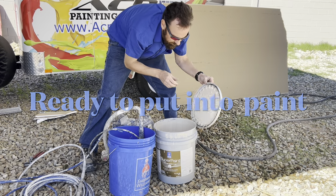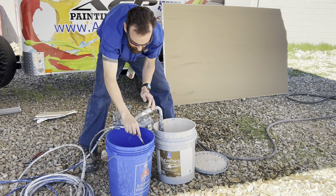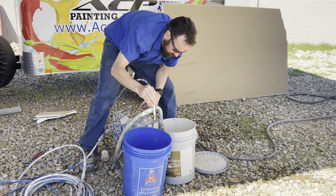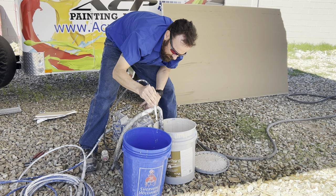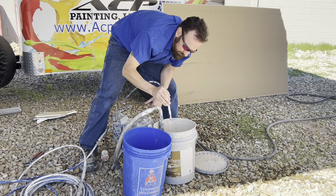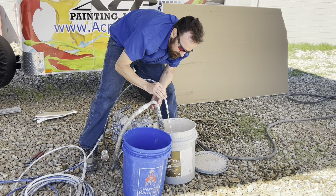Now we've inspected everything, ran the water through, and we're ready to go into paint. We'll put the pickup tube directly into the bucket of paint. One tip: if you're using paint that's not brand new — or even sometimes when it is — it's a good idea to strain the paint first, because that can easily clog up your rock catcher on the intake tube. Prime through until we see paint coming out of the prime tube, then switch it to spray back into the paint and let that go for a few seconds.